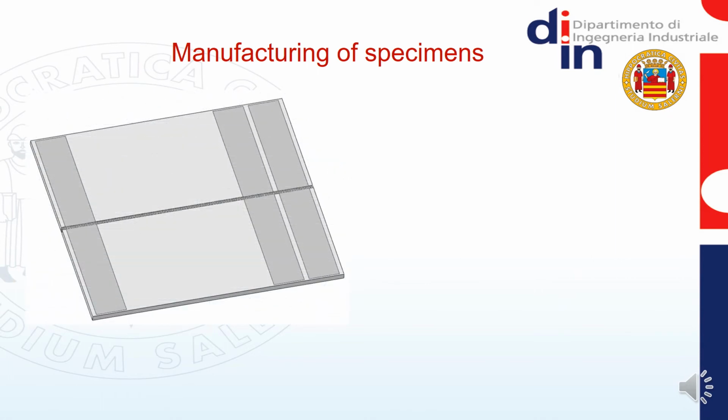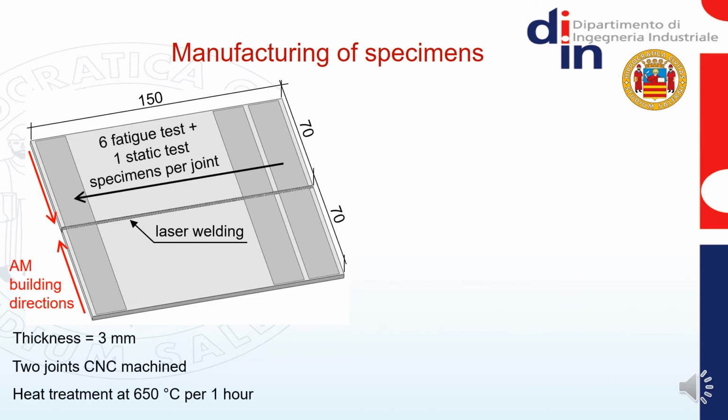Slices of material were cut out from the welded plates as shown in this picture. Here we can see that the laser welding was performed perpendicularly to the manufacturing direction. These are the main sizes of the final joints, where we highlighted the direction of the slices. These slices were consequently machined so as to obtain specimens for uniaxial static and fatigue tests according to their respective standards. 7 slices were obtained for each of the 2 joints for a total of 14 specimens.